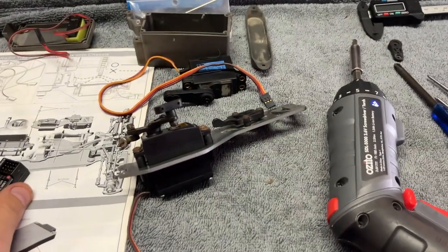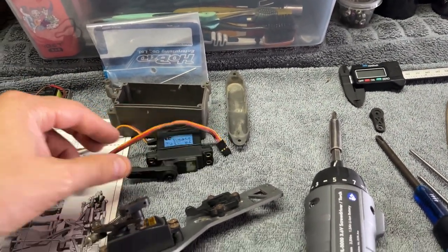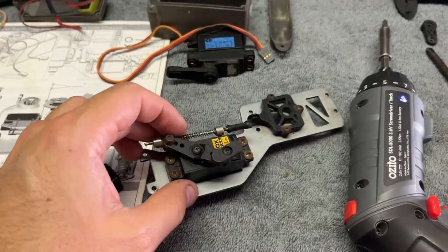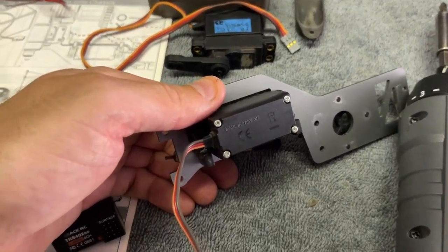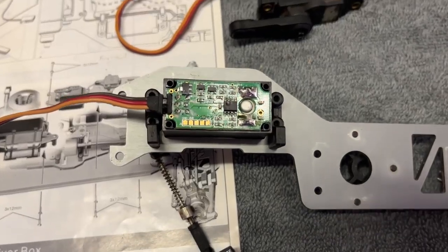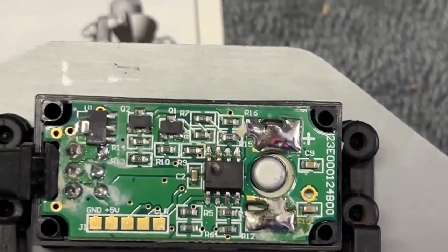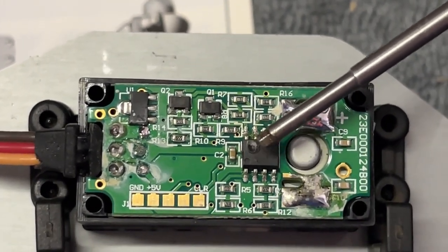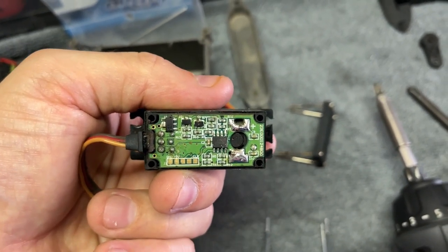We're testing the electronics with an Ace RC receiver, which comes from a Thunder Tiger — great radios. The steering servo, which is a 13kg JR, works fine. The Savox servo — 16kg for throttle — is dead. Let's take the screws out and see if we can find any obvious reason why it's dead. Is the digital motor seized or is something else going on? The board is burnt up. If you look at that big black MOSFET, you can see it's burnt up. Here's a healthy Savox servo for comparison — nothing burnt up, everything looks normal.